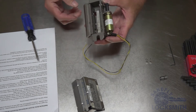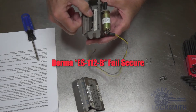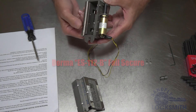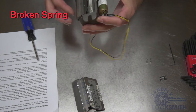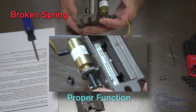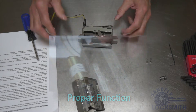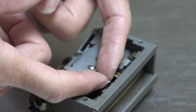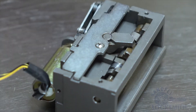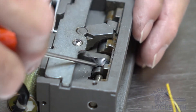Now you'd be able to tell what's going on. With this particular model, the ES-112B Fail Secure, normally this is latched. Whenever you push the solenoid, that should have a spring operating it. The spring right here is broken — it should have two legs, and here you can see it only has one. So this spring is broken and we're replacing it.